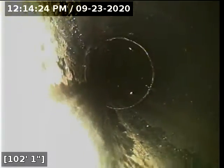You've got an unbelievable amount of head pressure that builds up, and you've got to fill up 145 feet of 4-inch pipe. The amount of water weight sitting on that blockage is extreme. And by and large, on a septic system, the only thing that should be going down here is toilet paper. Unless you get a guest who's putting things down the line that shouldn't be going down there. Like tampons and stuff of that nature.